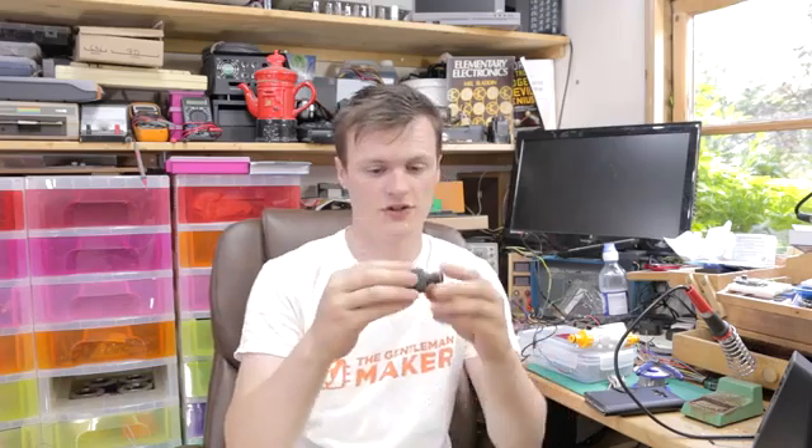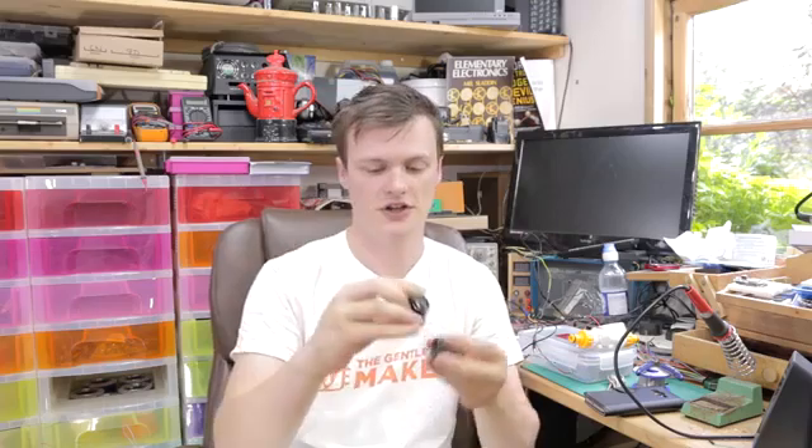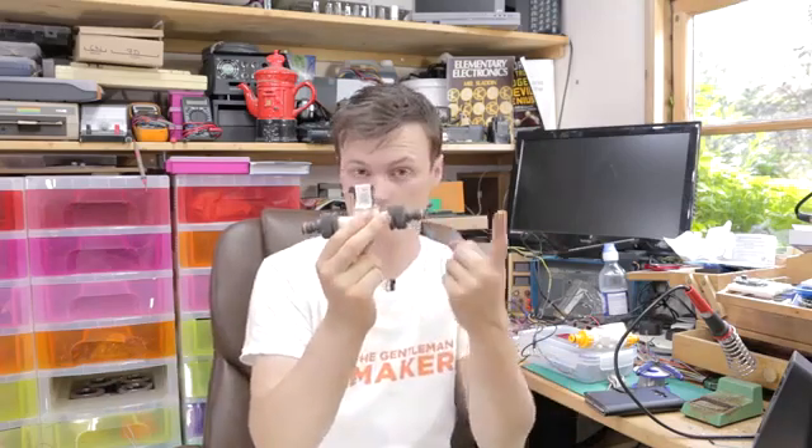So let's take a quick look at how we're going to plumb this project. Getting valves and stuff with solenoids can always be a little bit tricky. The easy solution was to simply buy a solenoid which is designed for use with water and it has half inch male connectors. The reason why you want the half inch is because you can get hose connectors which have half inch inserts. This allows you to connect hose pipes to the solenoid. You can do that for both sides and then the plumbing situation becomes dead trivial — all you need to do is connect one side to a hose pipe to the mains and the other side to a sprinkler.